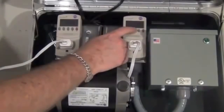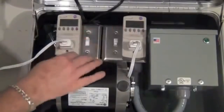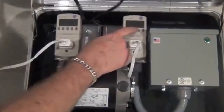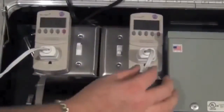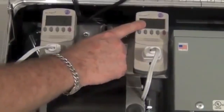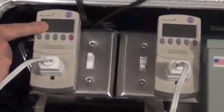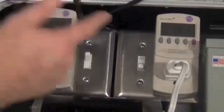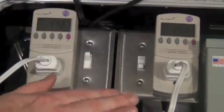I'm going to turn everything to watts. You'll notice that the motor itself is consuming 151 watts, but unfortunately you're being charged 172 watts. So you've got about 10% that you're being billed for that you're not actually using.